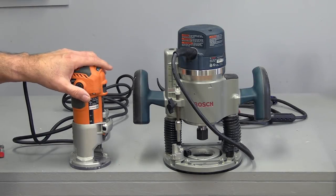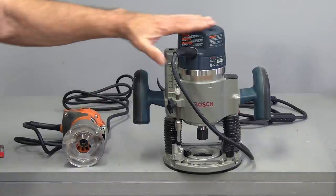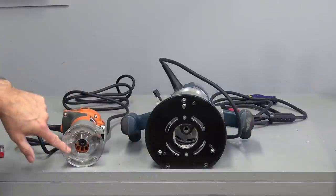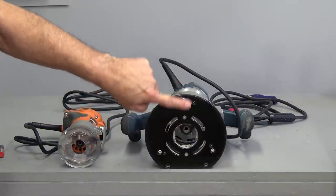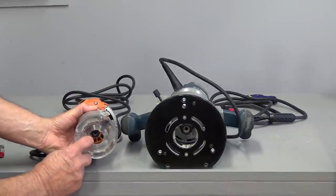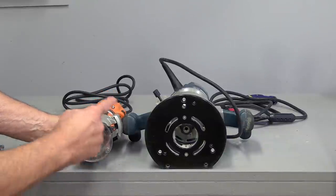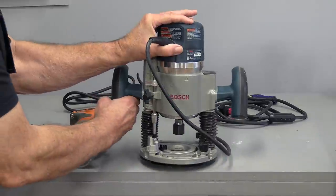The first technique I'm going to use today is a router. You can use a trim router, a little small one like this, or you could use a full size router like this one. I recommend a big size router like this, because the base is so much bigger — you can see how much smaller a trim router is. We need to make sure that we have a large surface area for the router to ride on. With a little trim router, once you get a bit in there, you only have a little area and it's much more susceptible to tipping. The other option would be to make yourself a much bigger, flatter base, but if you have a big router, that will be your best bet.